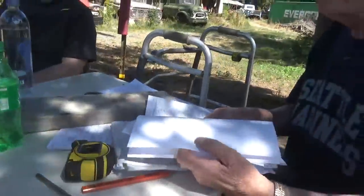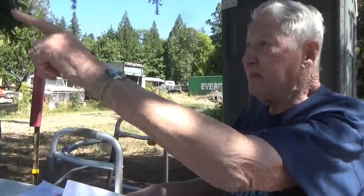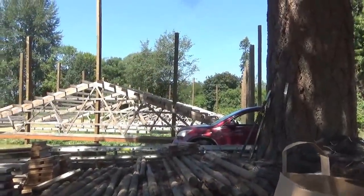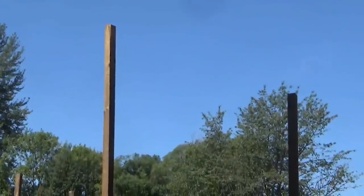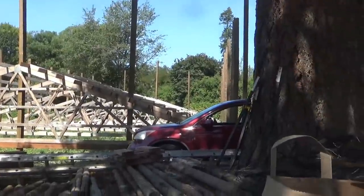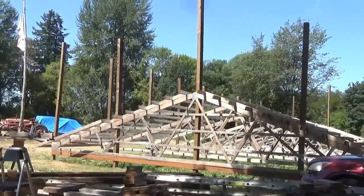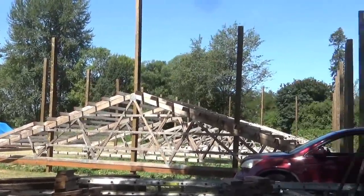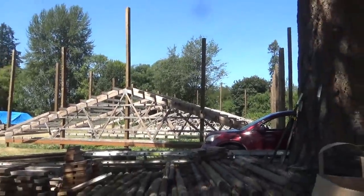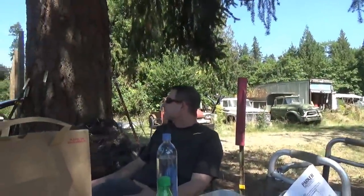Okay. So 25 pounds. The middle post there on the two end bays has got the most weight. The end bay here takes half the span between the two, which is 6 feet. That next post over takes 12 feet because it takes half the span on this side and half the span on the other side. So you've got 12 feet times 26 and a half. 26 and a half is your length. Okay. Got you.